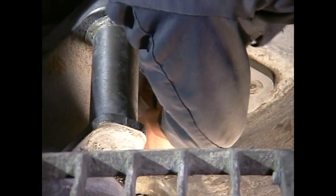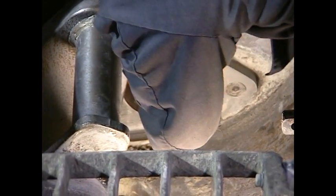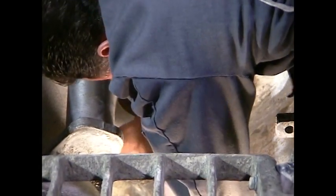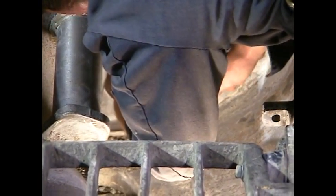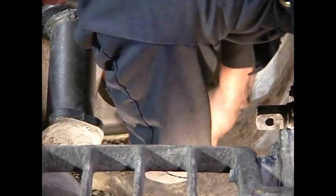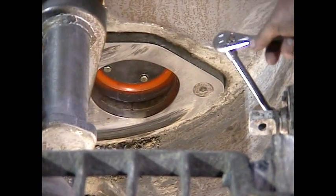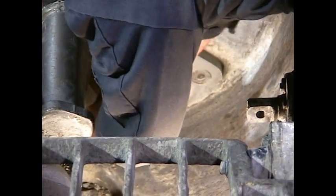Be careful with the sharp edges on the wear plate. Once you think you've got all four bolts tightened down snugly, go ahead and go over them one more time just to make sure they all feel about the same tension.